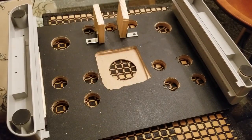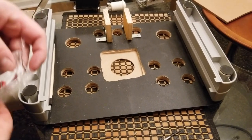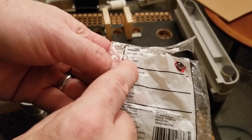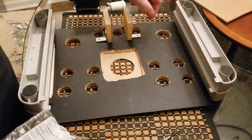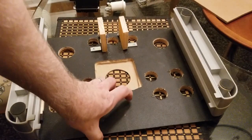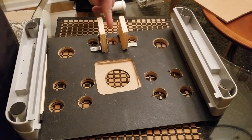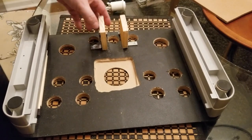I will take care of that using a drill to get a drill hole started. Okay, so here's what we're coming up with. And these are corner braces, 1 inch by a half inch, and it says zinc plated. So I've got them in there with some flat screws that are definitely short. They don't go through the thickness of this, fortunately. And then I took some other screws and shored up the wood on each side. I didn't go all the way through or all the way down flush, because these screws are actually longer than, again, the width of this. So just be cautious about that.